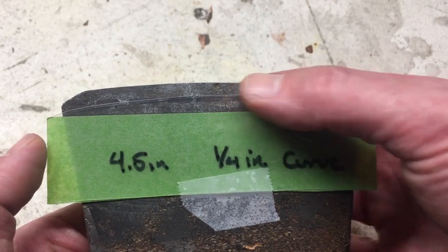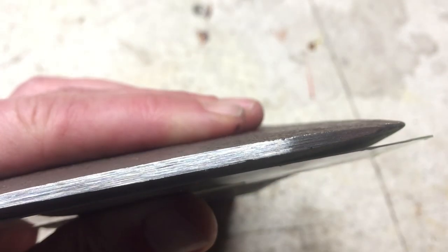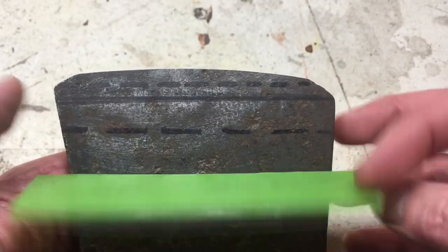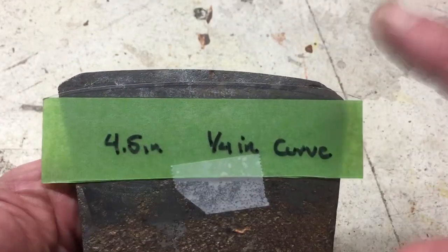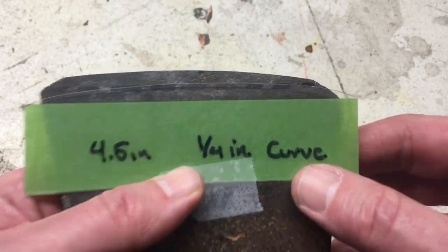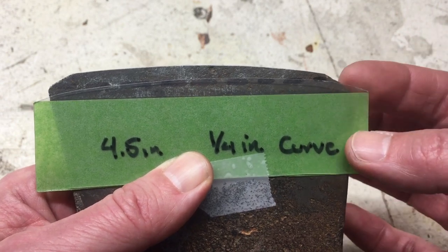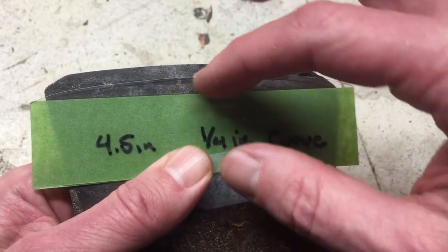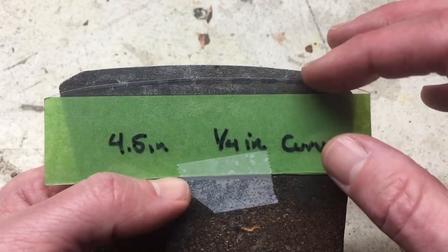It's not so much that I don't have metal going this way — we have a lot of metal to get to here. It's just that as you keep grinding, it gets thicker and thicker and thicker, and then I will have to sharpen this at some point. That's going to take a lot of metal off these cheeks, and we're trying to stay away from that. So I made a little template and I'm doing math in my head, trying to figure out the best way to do this. I think we're going to have to sacrifice a little bit of aesthetic perfectness on this top toe jammed end — I just cannot get there. But for the overall hope of getting to nearly the kind of grind Cook wants, that's what we're going to go for.